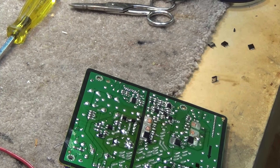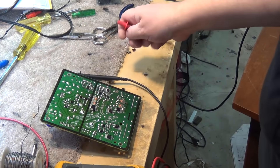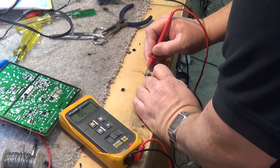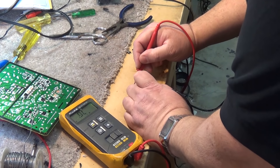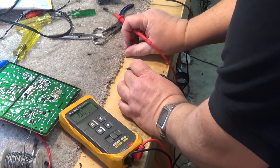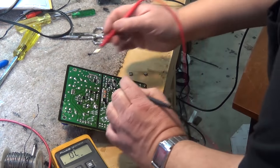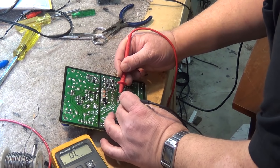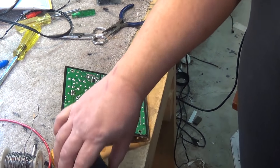That's how you remove the old parts. Now we're going to clean up the board and prep the new parts to install. Just to show that these transistors are blown — we take the meter in diode test mode and test them out of the board, and these are indeed shorted. The diodes that in video one looked like they were also blown — that's because they're connected across these transistors. Looking back at the board, those diodes are in fact not shorted; they're measuring current in one direction only. So the other diodes are fine — it was just these four transistors, and the drive IC is also going to be changed.